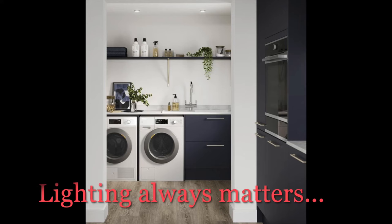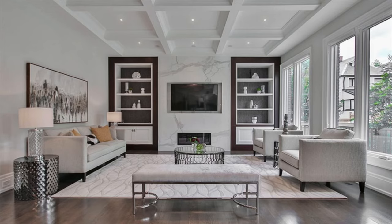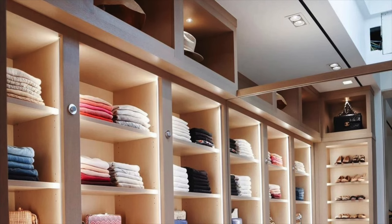So here's my professional opinion: use them. Save the money. Use them wherever you can — in a closet, in the basement, in places that don't visually matter, where you need task light, or where you want to save a little money: a playroom, a guest house. I'm all for it. You just have to know what you're in for — that you may have to replace all those fixtures down the road, and that you're going to get the glow in the ceiling. So use them sparingly. With a traditional recessed can, you get so many more options — ways to hide the bulb, aperture lights that pinpoint light exactly where you want it from a 12-foot ceiling. That's why you pay more.